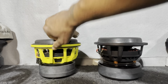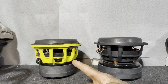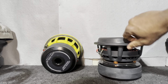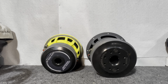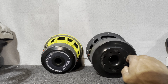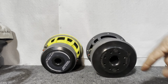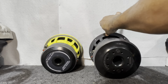Now let's look at the differences. Both of them have a two and a half inch voice coil. One has a sensitivity rating of 86, the other has a sensitivity rating of 79, so this one's a little bit more efficient. When we look at the motor size, wider is always better than taller. This is a lot wider motor on the Cosmos Audio, which helps with that 200 more RMS rating over the Ground Zero. Significantly wider motor — you guys can see that.